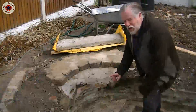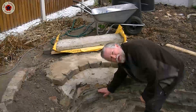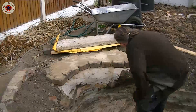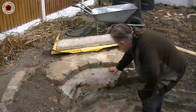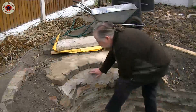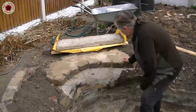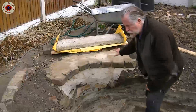Come and have a look inside. In the original pond, this was probably around the original height or maximum height of the water before. Now I've raised it up. These are the border stones and I've raised it up so the next height of the water is going to be about here. Because this is all backfill, I've taken some cement and I've shored up this piece of earth so that it doesn't collapse in on itself. Then I've put this layer of bricks with some concrete filled in between to make a platform for where I'm going to build the water feature.